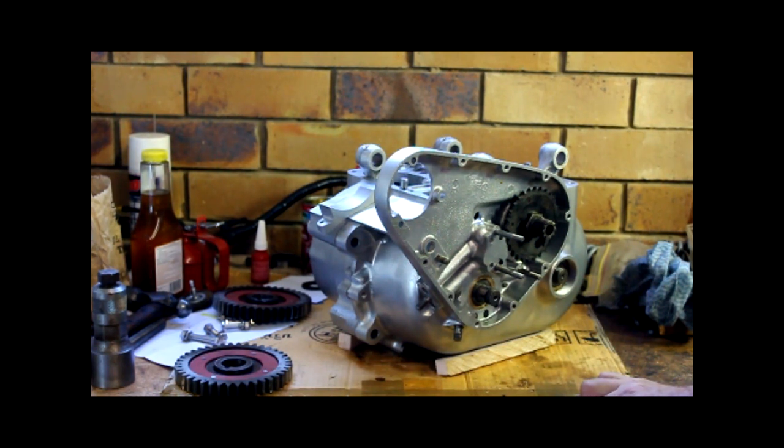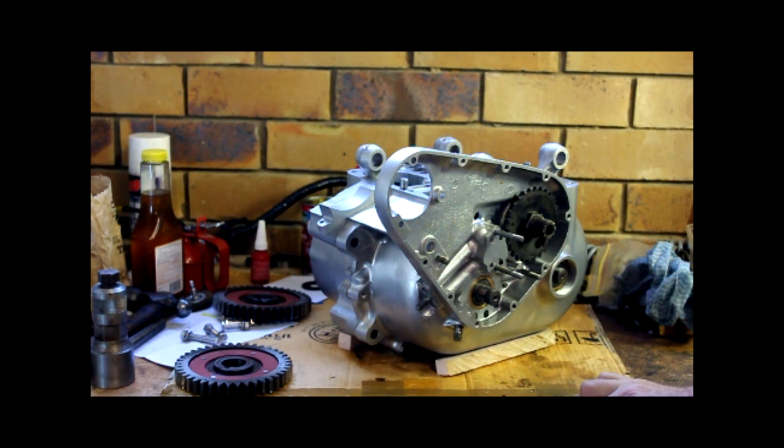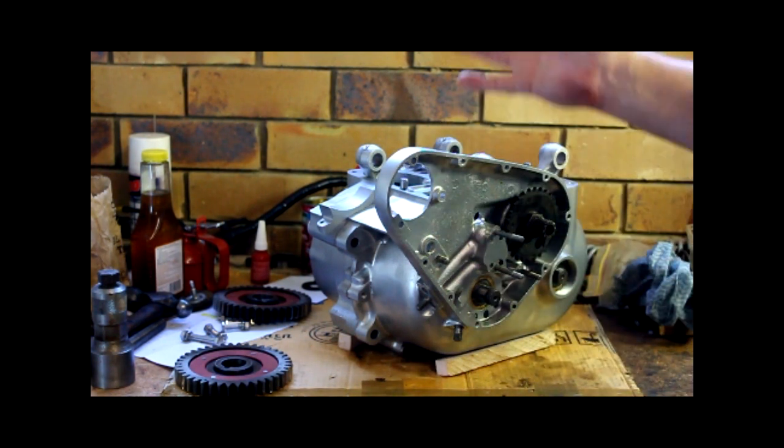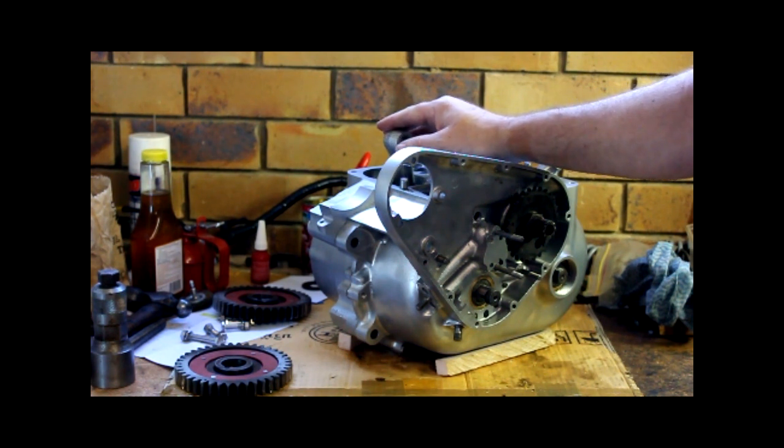The last thing I tried, and I guess it is the last thing I tried because it worked, was I turned around the cap. I tightened that up, fitted like a dream. It worked like it was always meant to be there. So I have no idea why that was an issue, but it's worked. Everything torqued up well, as well as being torqued. The nuts are held in with a little cotter pin, so the pins have been put in.